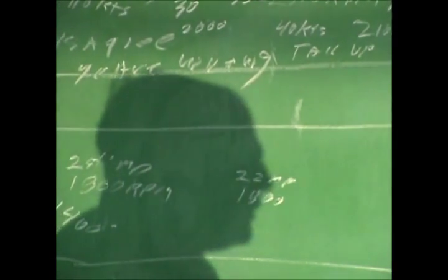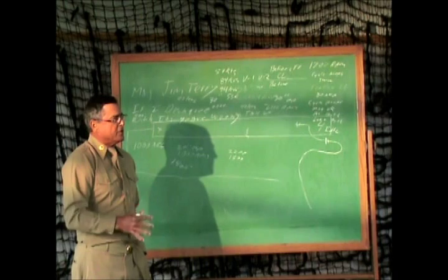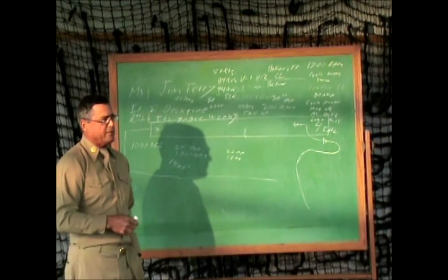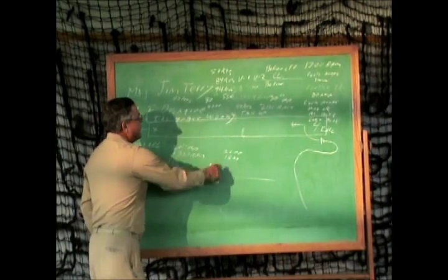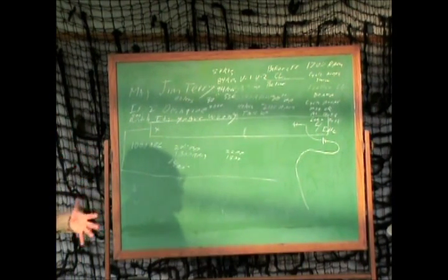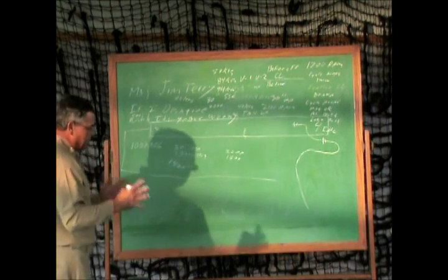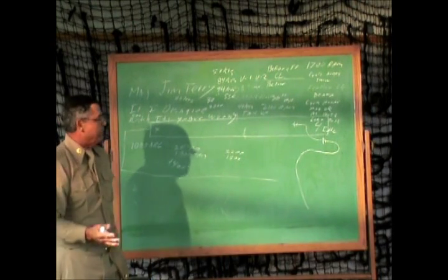Radial engines don't like people monkeying with the throttles. It changes temperatures. There's 160 alloys inside that engine. When it's running at whatever power setting you've got it at, all those alloys are at temperature, and everything fits, and everything is at the clearances and tolerances that the engineers designed it to be, and the engine's happy.